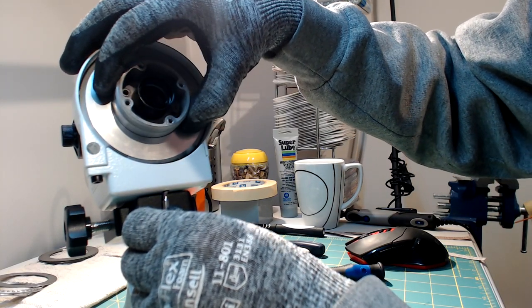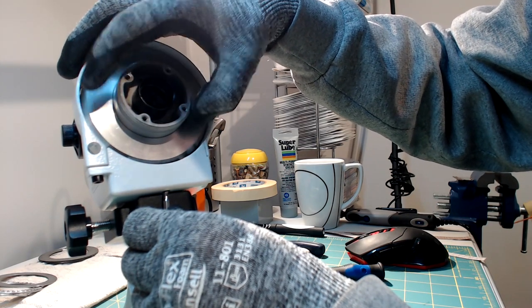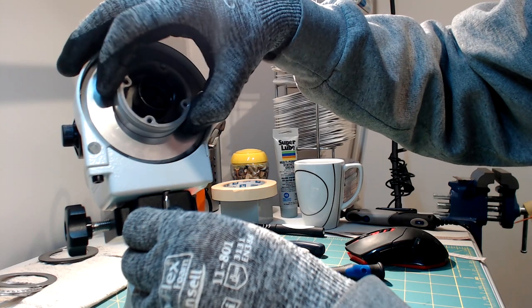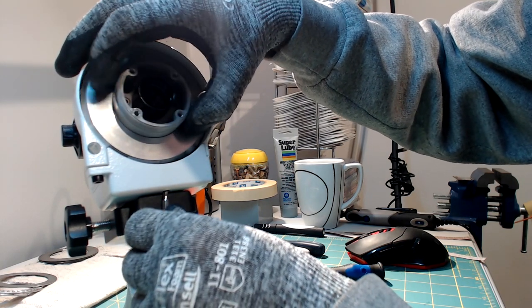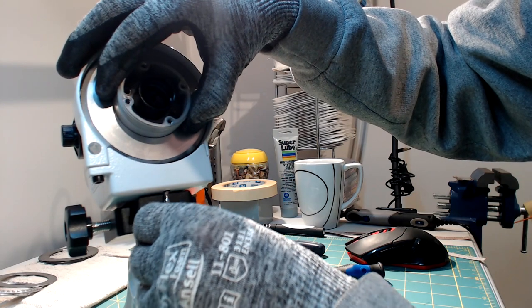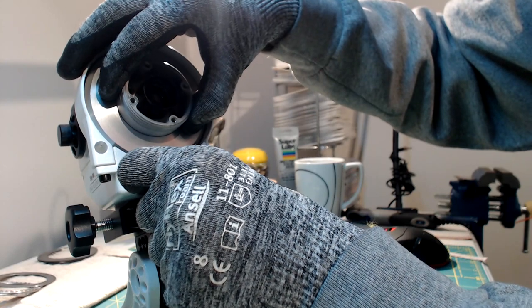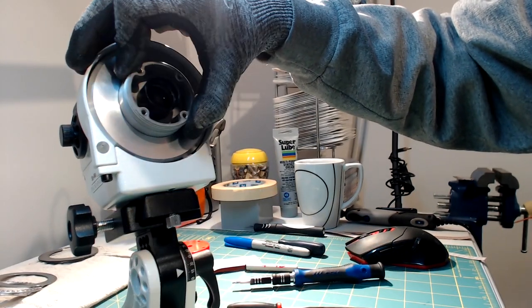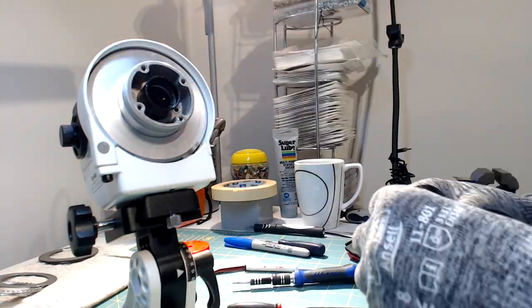Because if we're lifting our ring gear, we have backlash, our ring gear is gonna drop, we don't have backlash. Find the high point, bring up the backlash, it's out. Still got a slight high point, it's getting there though.